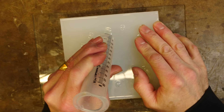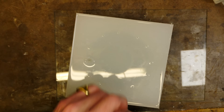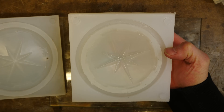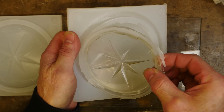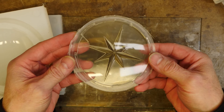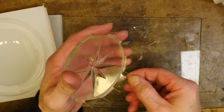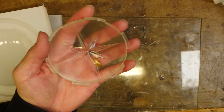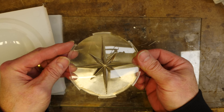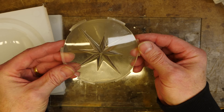Let's demold the part — pull off the little gobs on top, split the mold in half. You can see the vents, and we'll get the part out and take a look. Look at that — nice, clear part. Got a little bit of flash around the edges, which is very easily snapped off, and the vents come off like nothing. This is a duplicate of the original. Looks good. The backside will need a little cleaning up before it gets coated, but that's easily done by hand.